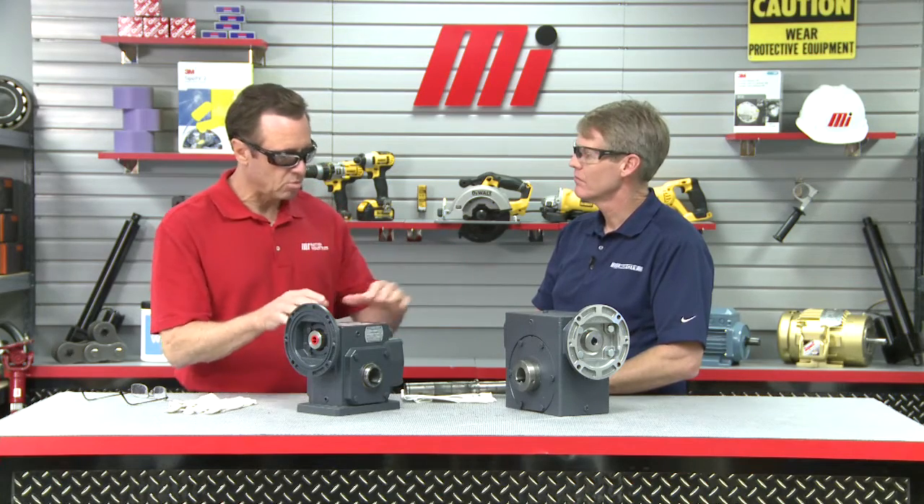The HERA is very power dense. Inside there are helical and hypoid gearing, and that allows us to put more torque in a smaller package. Now, when people start talking about that, they ask: what about heat? Is it going to be cooler? What's the difference in temperature? Great question. In all of our tests out in the field, the HERA runs on average 50 degrees Fahrenheit cooler than standard worm gear units. That keeps it a whole lot cooler.